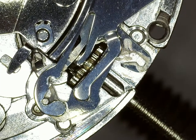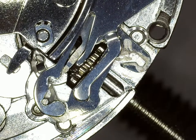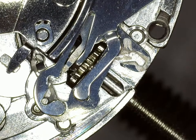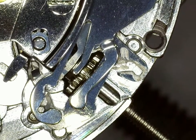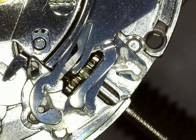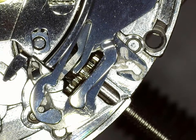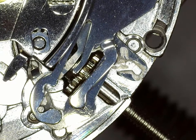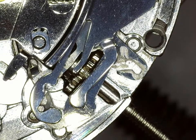This is basically like a castle gear — when you spin the crown counterclockwise, that's the winding mechanism going clockwise. When you go the opposite direction, this gear has sort of angular teeth on it, so it bounces up and down, and that little lever bounces up and down. That's the source of the clicking you would hear in the Seiko movement if you turn it counterclockwise.